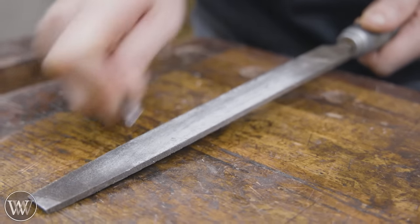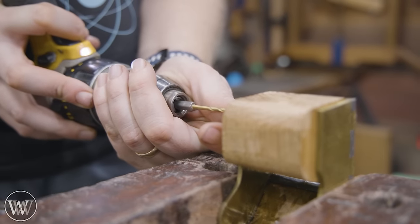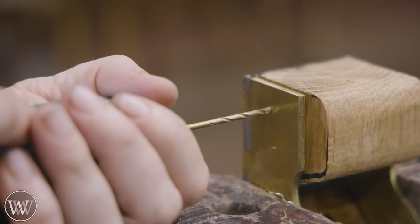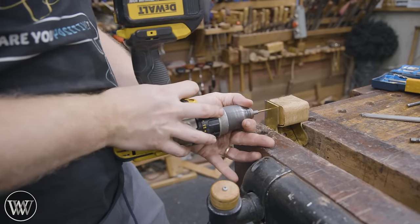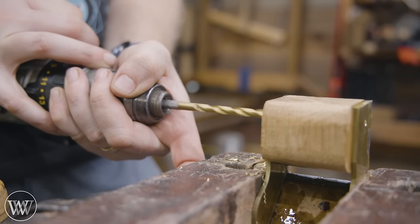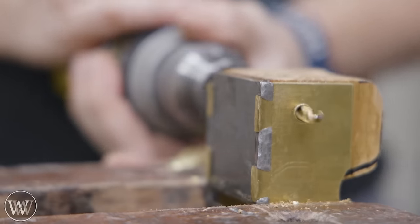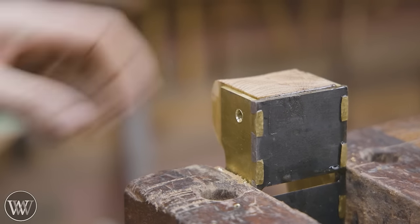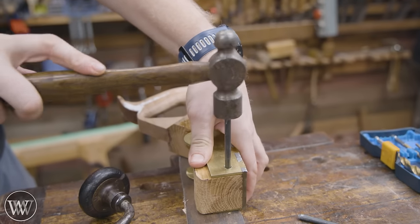Now once we get that all cured up, we're going to rivet this. The kit comes with a few rivets that have been sheared off, but I want to clean them up so they can drive through the hole nicely. I'm going to drill a test hole of 1/8 of an inch — this goes through the brass, through the wood, and through the brass on the other side. Then I come in with the appropriate size drill bit, which is 1/4 inch, drilling from one side and then from the other side for a good transition. Then I'm going to chamfer the edges of the brass a little bit, because when we put that rod through we're going to peen it over and let it expand — chamfering gives the steel head something to expand into.